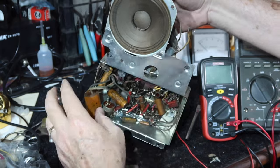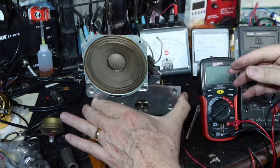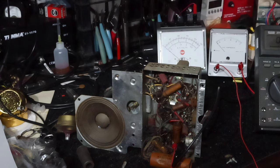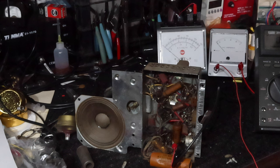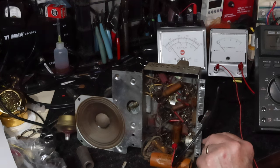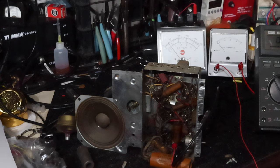Let's get the power pack hooked up to this and we'll see how we do again. Try it again. Bear with me. Okay, let's try again. I got the power hooked up. And once again, we're going to be watching the amps here, voltage here. We've got it turned all the way down. We should have continuity through the string now. So let's go. 10 volts, 20 volts. Make sure that's on. Yep. I expect we're going to hear a hum badly before we get to 110.